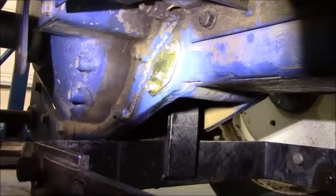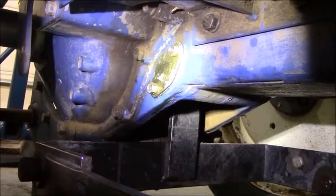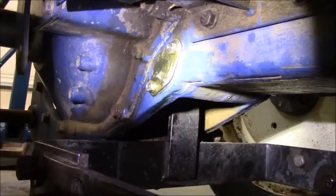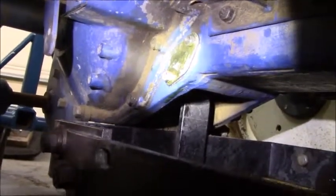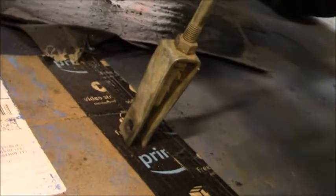The transmission slash hydraulic filter has been installed. Remember, it's on the right hand side of the tractor, right there where your sticker's at, explaining to you what all you got to do to it. I got them all tightened up. Like I said, there are 12 millimeter bolts that put those things in. And now we are going to go ahead and reattach our brakes.